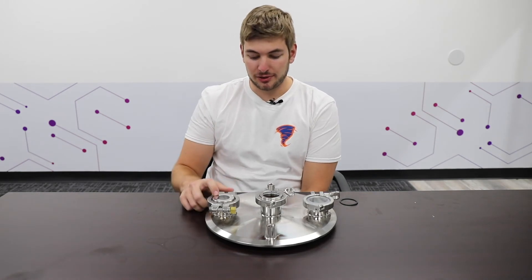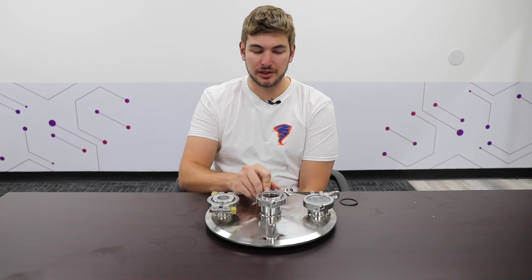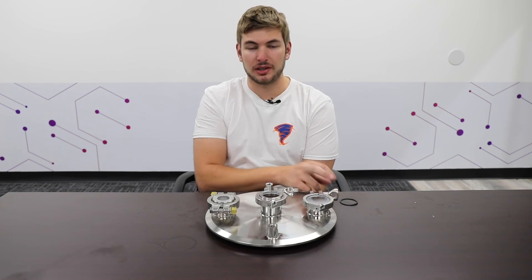The Metaglass is rated at 230 psi, and this is one of the best in the industry for pressure specs — widely used in many different industries. The borosilicate sight glass, made by BVV, also has a high pressure rating and is capable of standing up to propane or other hydrocarbons at pressures greater than butane. The polycarbonate sight glass has the lowest rating at around 225 psi, but you are still able to do propane mixes with your solvents at that pressure.